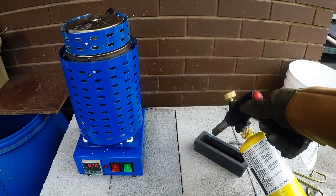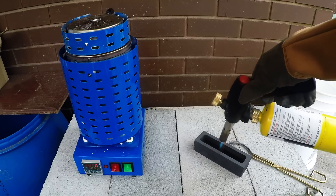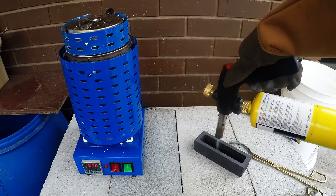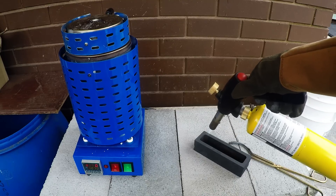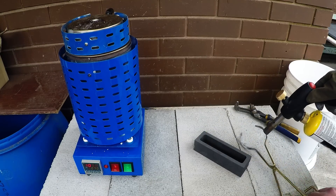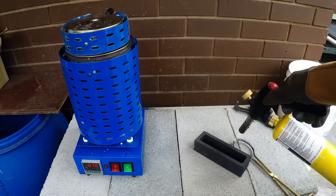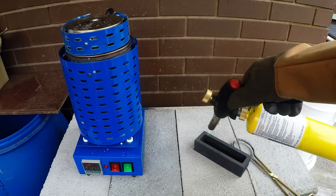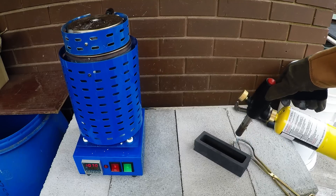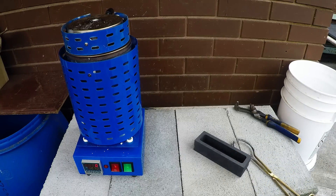I think I'm just about ready to pour — I'm going to give it a go anyway. I definitely think I had it too hot at the start. Who knows, I might have burnt away anything that wasn't copper. I know that brass is mostly copper and then it might be zinc or something else like that. So I'll just see how it turns out for the first pour — it's only brass anyway. I just want to heat up the tongs as well. From last time someone mentioned it's best to heat up the tongs, just so it's not such a big contrast between touching the crucible and the cold from the tongs.